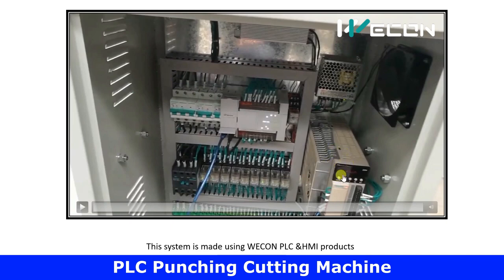The PLC outputs are connected to relays, and through these relays the outputs drive the solenoid valves and servo drive, which controls the motion of the motor. This is the main contactor — its purpose is to prevent the machine from starting automatically if utility power is lost and restored, which could cause damage to property, equipment, or personnel. There are also protection MCBs, a heat sink for the VFD or braking resistor for the motor, and a terminal board for inputs and outputs.